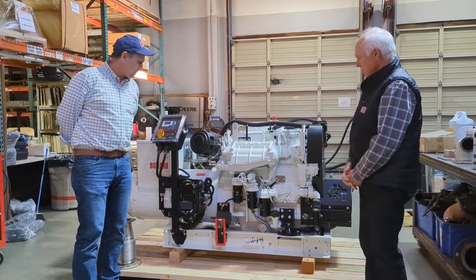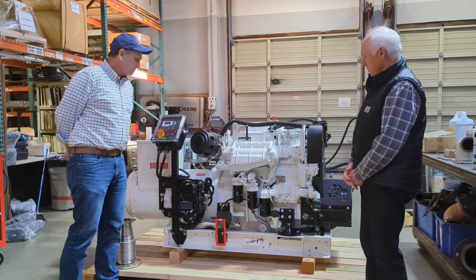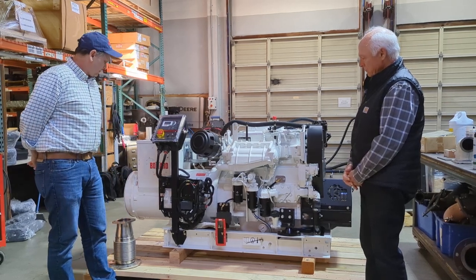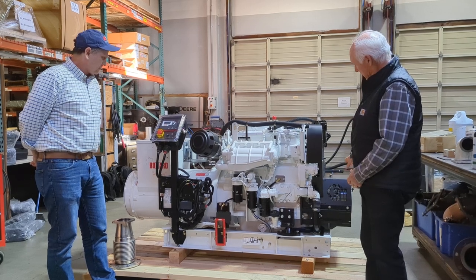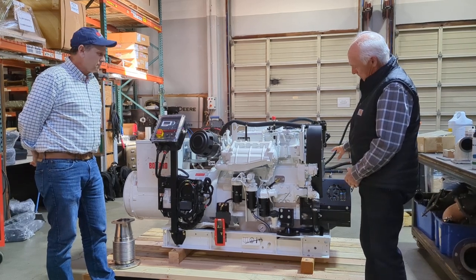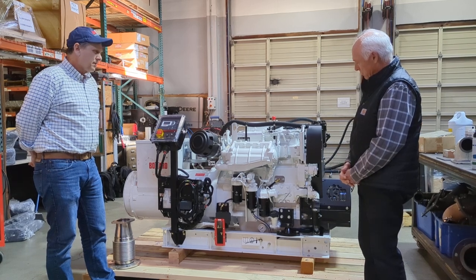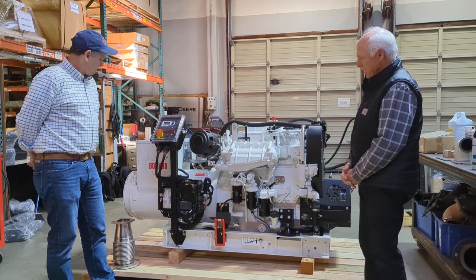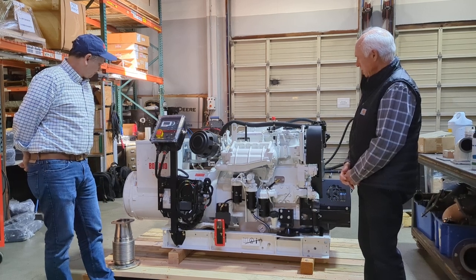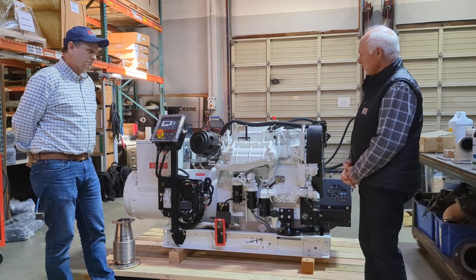So this is a BOLLARD 99 kW continuous duty machine going into a tugboat application for continuous duty. This particular one has a front power takeoff with a 1200 foot-pound electric clutch for auxiliary drives. It's got a Marathon Mariner generator end and a John Deere 4045 AFM engine driving it.